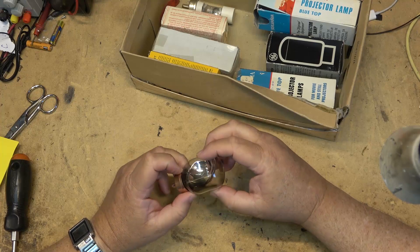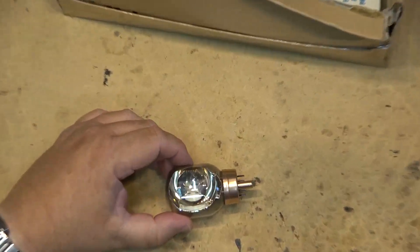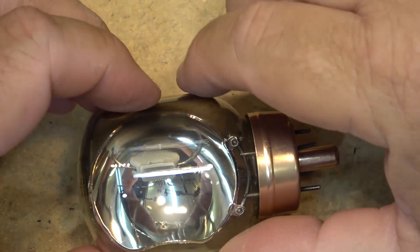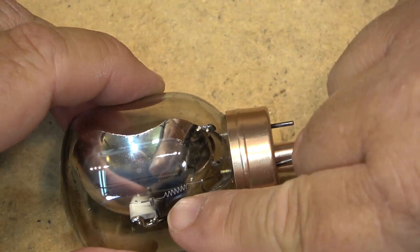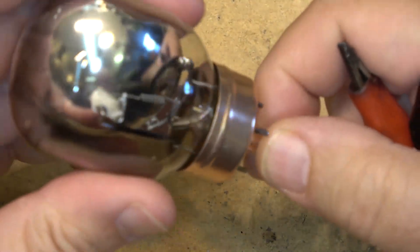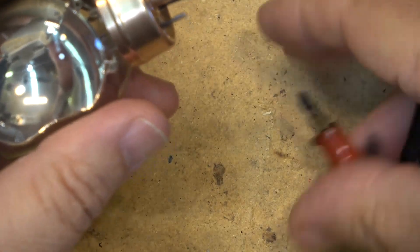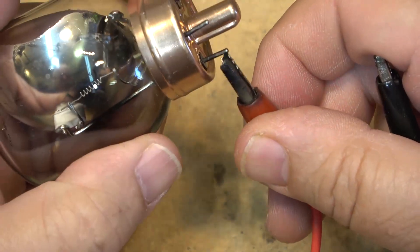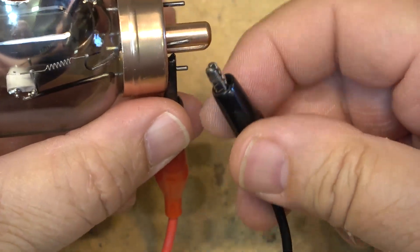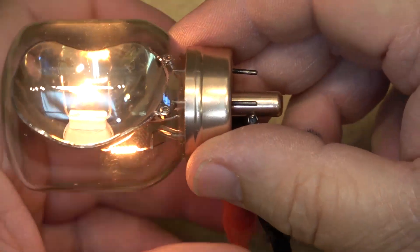This one looks like it's been used a bit — it's kind of black. It's rated at 120 volts, and look at this: it's two bulbs in series with each other. You get the main bulb which has the parabolic reflector on it that would illuminate your film. These would be for a movie projector or slide projector. It's got a second filament on there. I'm going to power this up with my power supply set to 32 volts, so it's going to light up if it works, but it won't light up at full brightness. The two pins at the front are actually connected together — if I connect something across them I'll get sparks because they're shorted. The other two pins are connected to the filament. When I connect this one up we should get light — and we do. We've got a filament at the back that lights up and the main filament that lights up at the front.